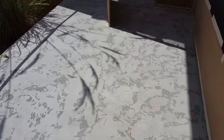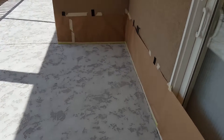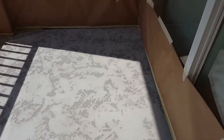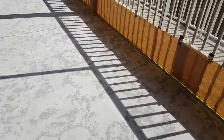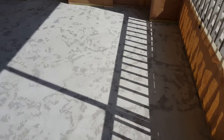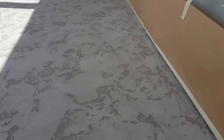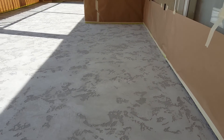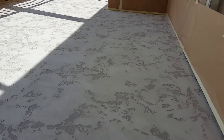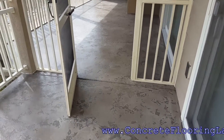We have the texture on. We've got everything papered off and we are ready to spray the antique stain. We're going to darken this down just a little bit. The sun's creating a lot of shadows, so it's probably going to distort this a bit, but you can see the Tuscan slate texture — darker base, lighter top coat. It's already got a little bit of marbling going on on our top coat, and there's variation between the base and the top coat that you can already spot.